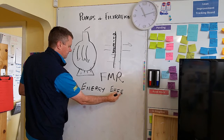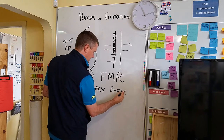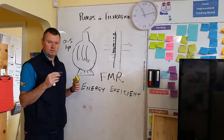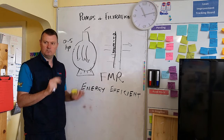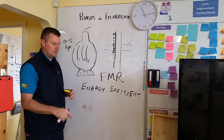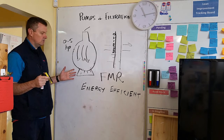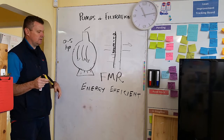Always go with an energy efficient pump. Have a look at our VS pump programming video uploaded yesterday — that explains the process we use for the Hayward energy efficient pump. It's not a case of just putting one of these on and going 'you beauty' — you've got to actually tune it up to the system. You have to have an operating pressure gauge to make sure you're getting good pressure through that filter to make sure it's working properly. This stuff really is not DIY — it's definitely not DIY.